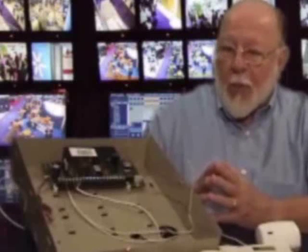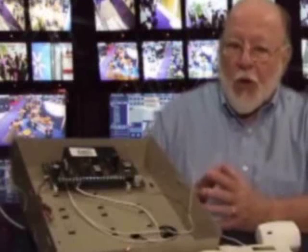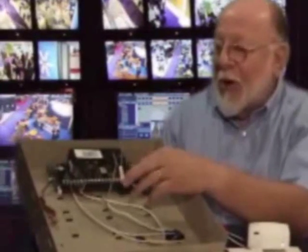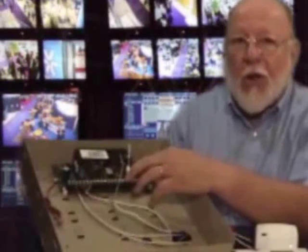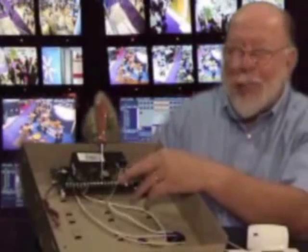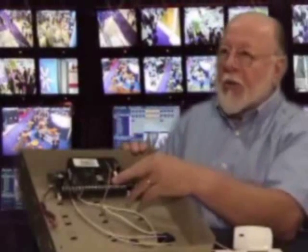We'll get into programming in the next step, but for now you should just look at how Honeywell has pre-programmed the six zones. All of our sensors will be combined to go on those six zones depending on what their function is. Every zone requires one resistor. The resistor goes in series with all of your normally closed sensors. Some people like to mount them with the detector — there's a variety of ways to do it, including connecting it in the cabinet. You'll notice that the zone screws are labeled high and low. We like to connect all of the resistors to the low screw and the single sensor wire to the high screw. That way, you can stand back and look at the panel and see a wire, two resistors, a wire, and know that you've got an even, uniform wiring job.